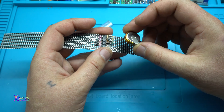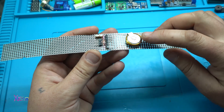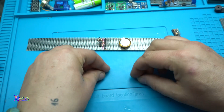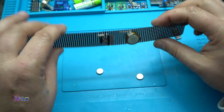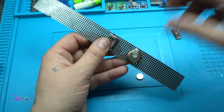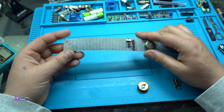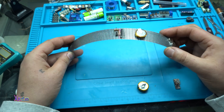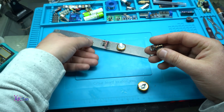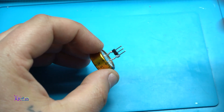For the first example I'm gonna use LEDs, but first I need a power source — so I'll solder the super capacitor. I've soldered the super capacitor and now I have a power source. Using two neodymium magnets I'm gonna make this flexible board into a wearable gadget — yep, I'm gonna wear it! From a flexible printed circuit board you can make a cool-looking wearable gadget. It's finished — here it is: the main module, pre-programmed, and the super capacitor with pins as the power source.